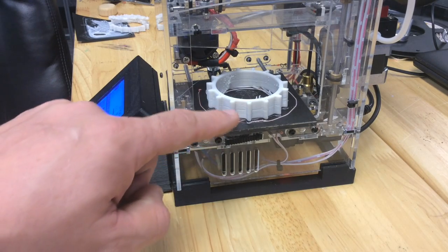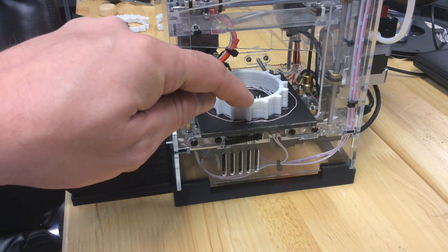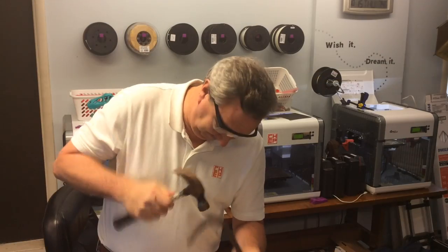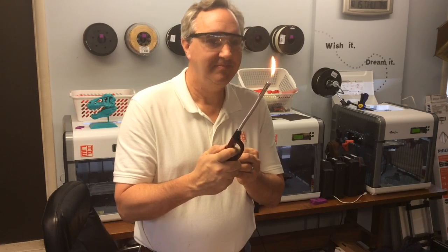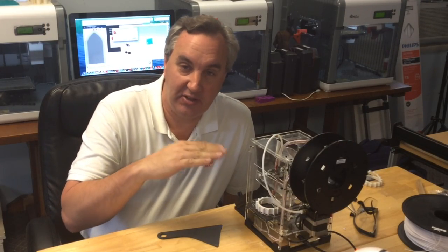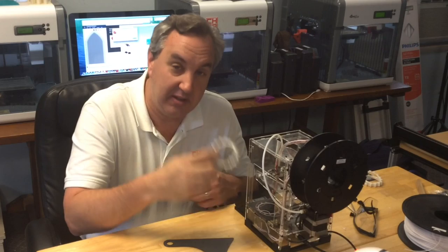The finished print came out pretty good. It's still got a line in the center, which may be part of the design — I need to go back and check. I still got some holes in the top so it didn't fill in quite as nicely, and there's definitely some stringing, but this is so much better than the previous print. Cleaning the nozzle and slowing things down with different settings made it a lot better. Getting it off the build plate wasn't that bad either — because I adjusted the bed height and had the filament just barely coming down, it stuck perfectly and I just used a plastic putty knife and it came right off.